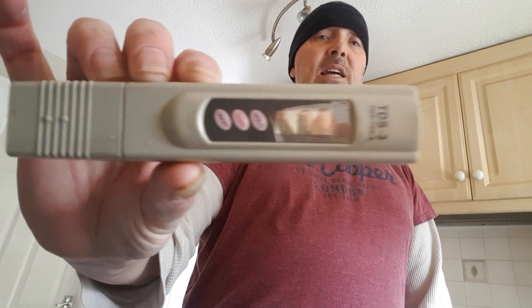Some people will say you can clean windows with water that's only 10 parts per million, or even 20 ppm. I've even heard lads saying they use water up to 50 ppm before bothering to change out their cylinders. We don't — we use zero across the board. We tell the customers it's 100% pure water because that's what we're selling and that's what we give them, nothing less. To quickly start: get a TDS meter, 10 to 15 quid off eBay. Streaks are normally from chemicals; spots are normally from minerals and sediment.